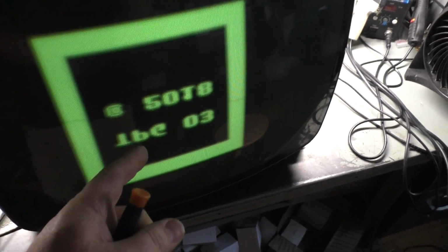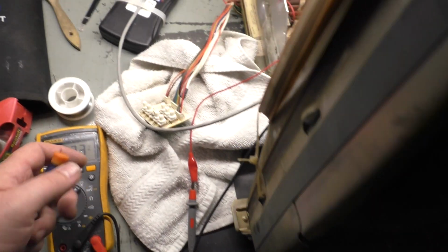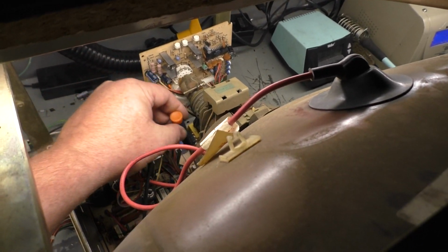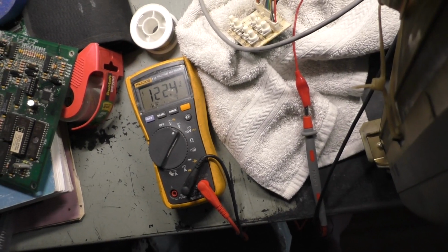Looks like we're missing blue though. Wow, 2 in a row missing blue? Crazy. We're upside down. We can flip the vertical, that's no problem, but it is working. We need to adjust our B+. That clicking that you heard is almost surely the flyback. But let's get in here and tweak our B+ to get to 125 here.